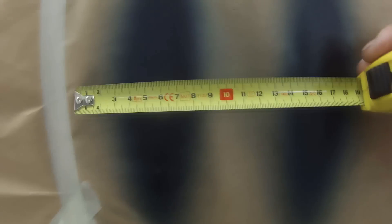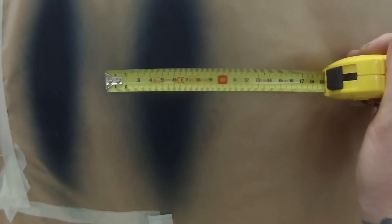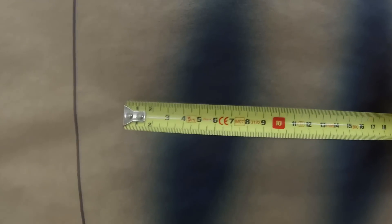The main thing I'm really noticing comparing the HVLP, conventional, and low volume low pressure is the width of the spray fan. Going from edge to edge of the overspray, you're looking at about 11 or 12 centimeters for the HVLP. Higher pressure is actually going to narrow that fan in, so you're probably looking at about 11 centimeters. Next up is the conventional - definitely more narrow than the HVLP. At higher pressure it narrows in again, around 9 centimeters. The low volume low pressure is also around 9 centimeters, and at higher pressure you're looking at about 8 centimeters.